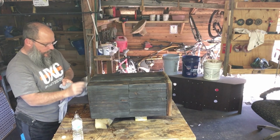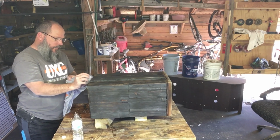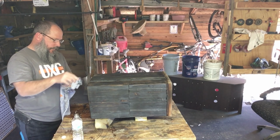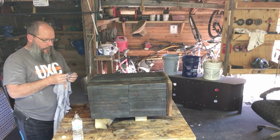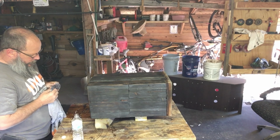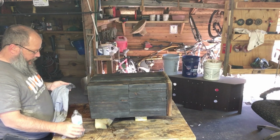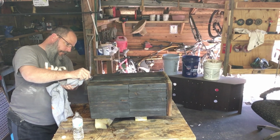But again, that's part of Shou Sugi Ban. I mean, it's just part of it. You are burning wood, and especially with the gaps and that kind of thing in there. Again, this is all scrap wood that started out different sizes and different lengths, and you got round pieces and square pieces and everything that had to make fit, and it does not fit perfect. So with all the spaces, you are getting air in there, and what does fire need to burn? It needs air. So I mean, it's getting everything it needs.